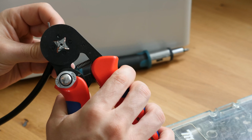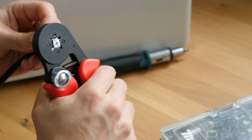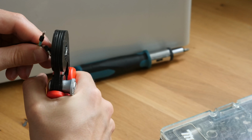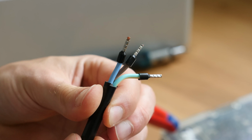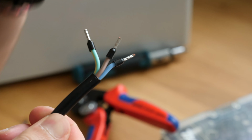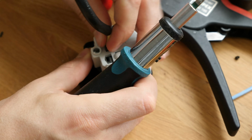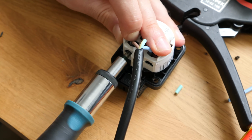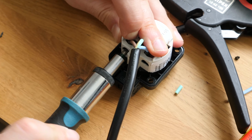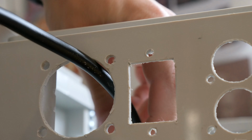In my case, the screw terminals for the AC out sockets were blocked after mounting into the housing. Wherever possible, I've used wire end sleeves or ferrules. In some cases, the result was too thick to go into where I wanted it to be. This was, for example, the case with the relay board, or when I tried to stuff 5 cables into one chandelier terminal.